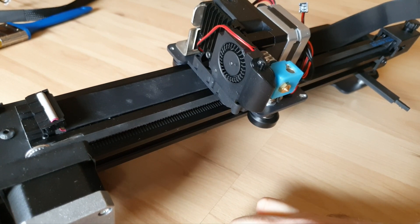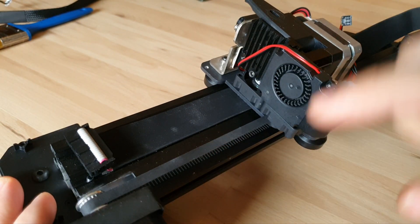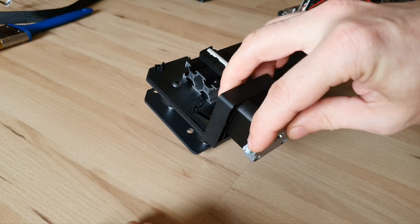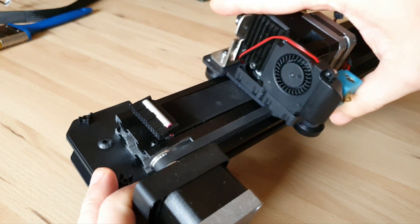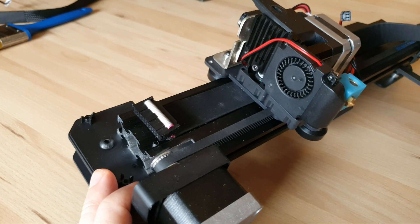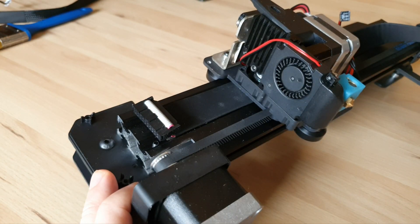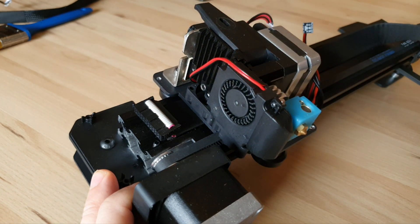It is nice to have your stepper motors detached when you're doing this, because when you move your axis you're actually generating electricity in your stepper, and it'll feed back through the pins and go back to your mainboard. You want to avoid that. If you do it too fast, you'll actually see your screen flicker even if you have no power connected to your unit — that means power is actually feeding back from the motors going back into your board. That backwards power is no bueno, so we want to avoid that.